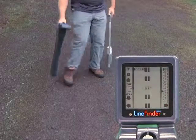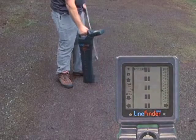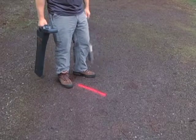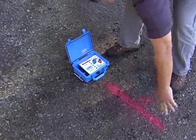We turn the line finder to trace the way the line runs. Use the track screen the same way you do for regular line tracing — in line with the line you're tracing. I've painted a line to mark which way this unknown source seems to be running. Now I'll lay down the buzz box right over where the line is.